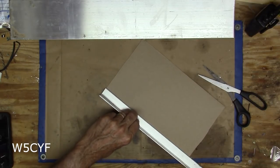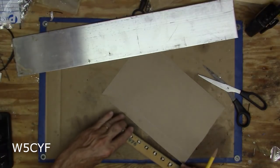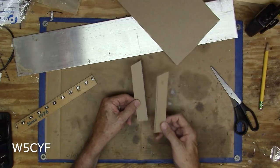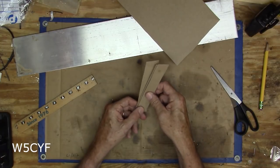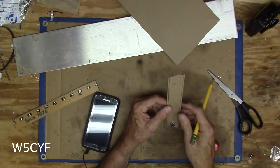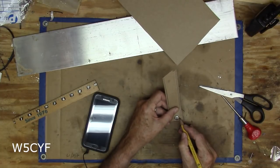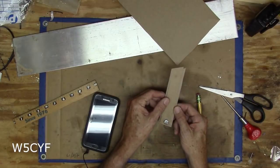What I'm doing right here is making the side of the angle iron, and this is going to let me know where to put my screw holes. Now that I've got this cut, essentially one piece is going to be stationary and another piece will be bending down — this becomes the hinge point right here. I've got just a quarter-inch bolt through there, and I'll be using stainless steel as my hinge point. If I put it right there, this is going to give this end plenty of clearance. I'll also come down and cut a little bit off this corner with the grinder, just make a slight angle, and that will be the hinge point.